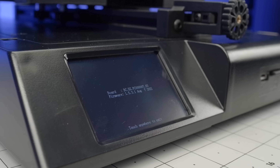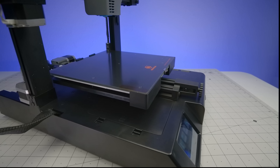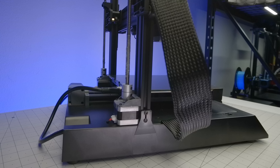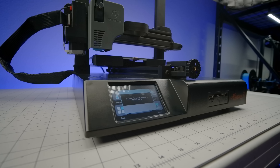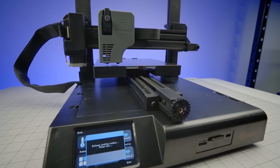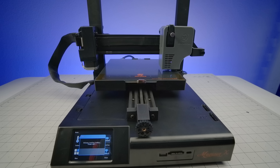Let's cut to the fancy motion control pan. The Magician X features an impressively responsive 3.5-inch color touchscreen, a 230x230mm third-generation silicon carbide glass build plate, a direct-drive dual-gear extruder, and a pair of Z-axis motors with the lead screws locked in step by way of a timing belt. Coming back to our theme of outward simplicity, you'll find no adjustment nubs under the build plate. Instead, the machine performs a quick 16-point mesh leveling routine directly from the home screen, though you can still evoke it with the G29 command if you're so inclined. That is the printer: simple to assemble, simple to operate, just plain simple.